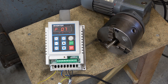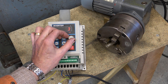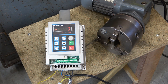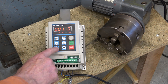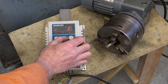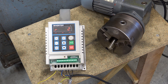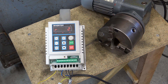P72 is called the torque compensation amount, which can be 0 to 100. I've arbitrarily set it to 50 to see if that makes any difference. It does — 3 RPM. It's got us down to 3, but it can't get us to 1. Setting it to 100: still 3 RPM, then 2 RPM, but it's nowhere near as smooth as when driven with the other inverter. And it won't get to 1 — 2 is its limit.